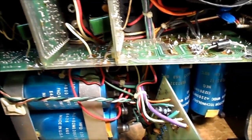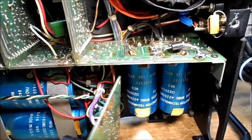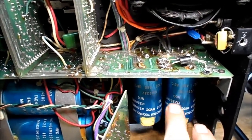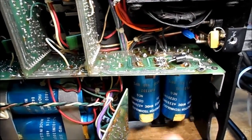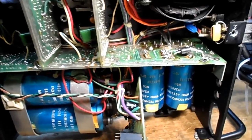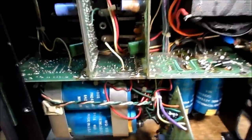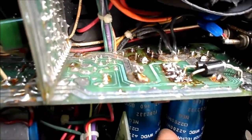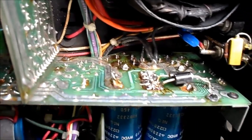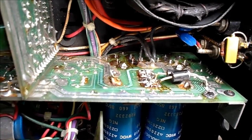Left and right channels there. What I'm going at — I've already started here — these two capacitors. They're dual capacitors: one's for the positive supply, one's for the negative supply. It's just horrible to work on. They're on this PC board that's all soldered in, and of course they're down on the bottom with all these wires attached. I'm going to try and get those two capacitors out of there.